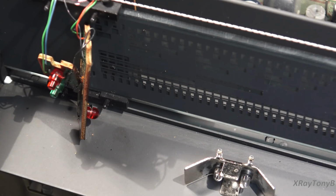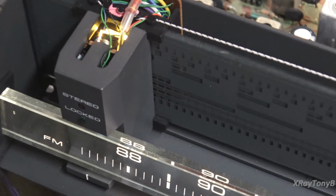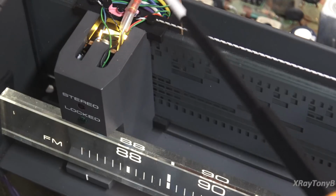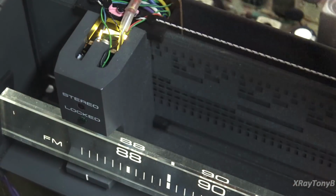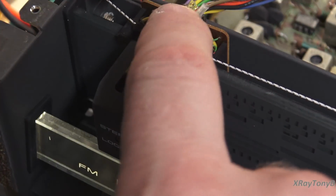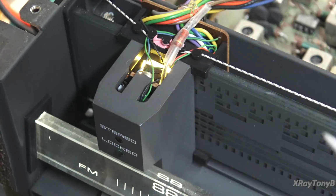Alright, let's see what we can get done with this. Okay, I have the bulbs installed, and I ended up going with LEDs, and they're warm white. They were a perfect fit, and I just had to use a little 220 ohm dropping resistor, and that doesn't seem to be getting too warm. I'll have to keep my finger on it. As tiny as that resistor is right there, that's a 1 watt resistor. I can always cut off the heat shrink if it ends up getting too warm. We'll just keep our eye on it.